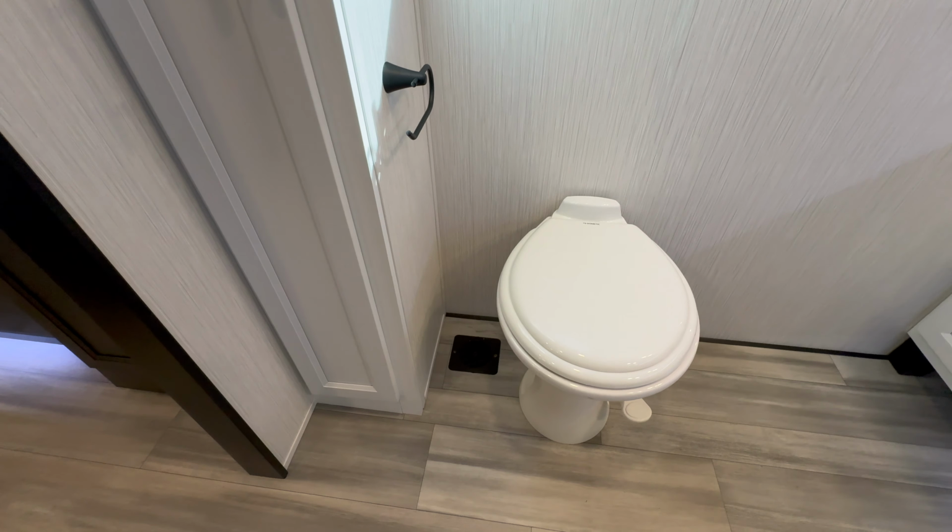Now, the P-trap set into the sewer hose is something many RVers have done for a long time, using whatever materials are available to trap fluid in the sewer hose to create a barrier from the sewer connections. The RV Snap Trap takes this to an intentional level and firmly grips and supports any flexible sewer hose to form what Al calls a code-level P-trap that will completely eliminate any infiltration of sewer gases, flies, or other insects up into your RV's plumbing system from the campground sewer system.